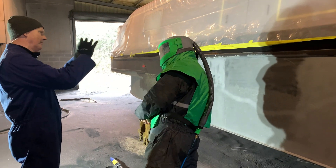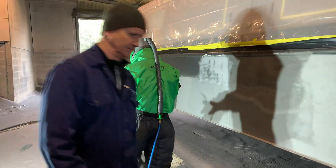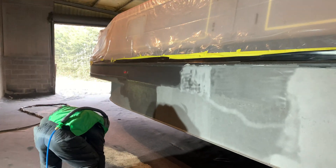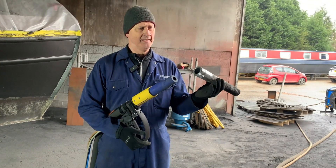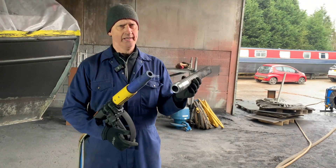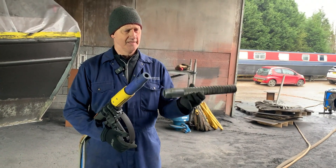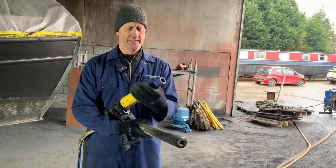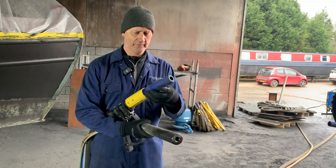We've also been trying the new Excel nozzles. These have a very efficient venturi inside them, so the speed and blast pattern from this nozzle is much greater — you get better productivity for the same amount of abrasive. These nozzles simply interchange into the holder at the end.